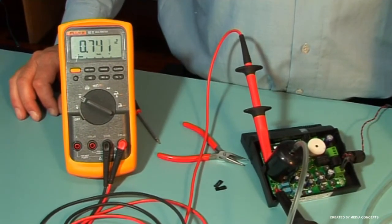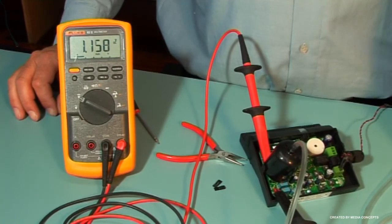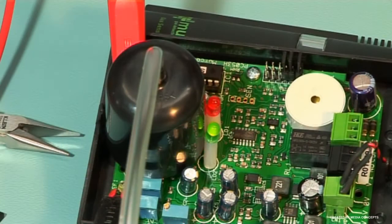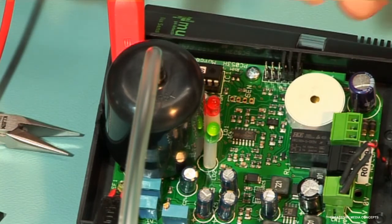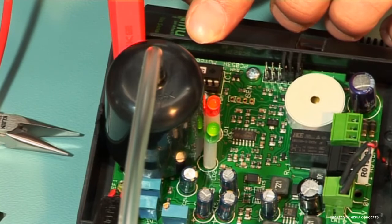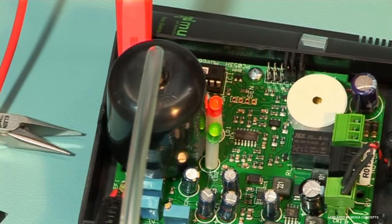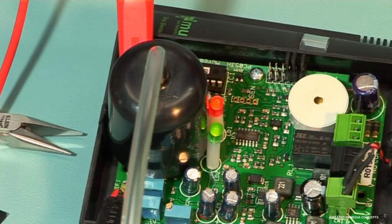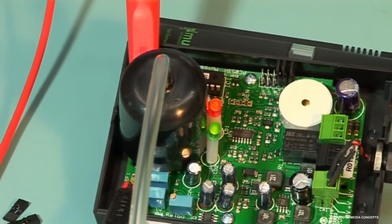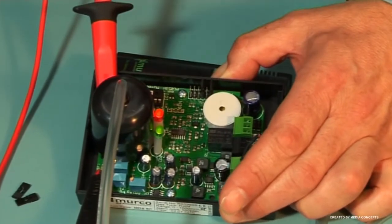Observe the voltmeter output when the unit goes into alarm. This should correspond to the alarm set point as on the rating label, which should be the factory settings or your own local settings. Once you've reached the alarm set point, the red LED light and the sounder, if enabled, will activate. The relay should also activate, and if the MGS is connected to the remote MGD panel, they should also activate the yellow and/or red LED for the alarm on the panel. The sounder can be muted by removing JP2.